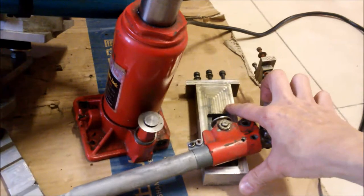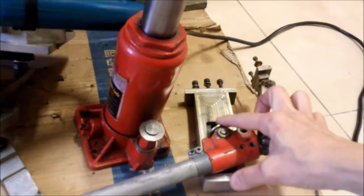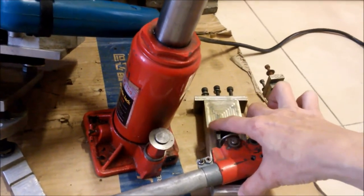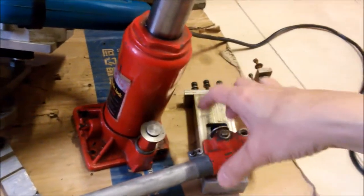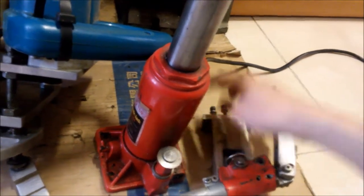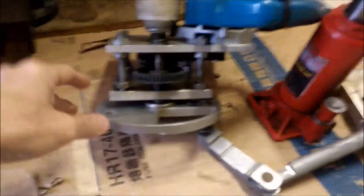The second mechanism is here — the lever arms and the sliding block. This circular disk will touch this one, and this slide constrains the motion to only vertical — upward and downward. This is the hinge point, and all of this will be fixed on a platform.